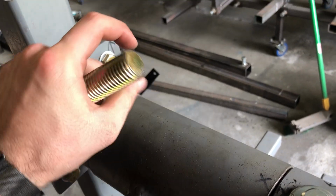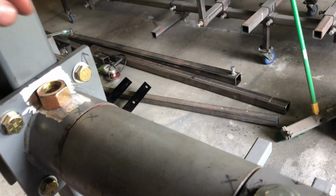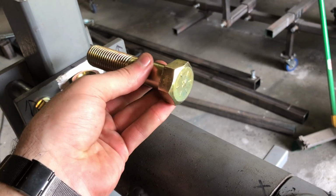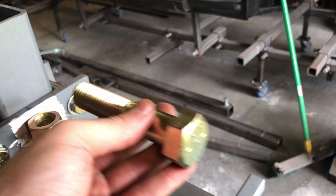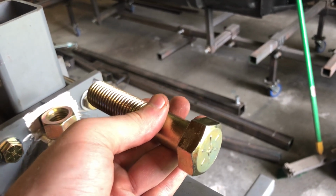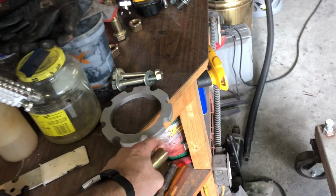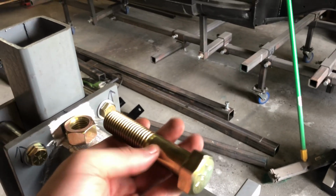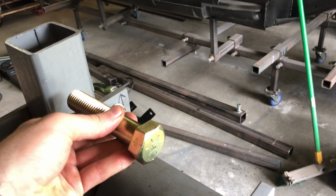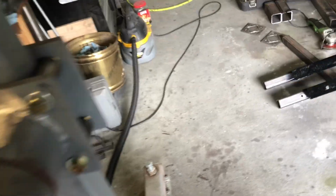There'll be a spring in the middle with, I think they're called bearing collars or something like that. They're just little round rings with an Allen screw that locks it in place. But it'll be sprung to where you can pull this back, and it'll have a T on this back section here, where you can pull it back, turn it, and it'll have something to rest the T on that'll lock it back. And then you can rotate wherever you need to, get it in place on these teeth. Hit that T up off the lock mechanism, and it'll spring back in and lock in place. And that'll hold it in place for me to go and secure these safety nuts. But that is the next on the agenda.